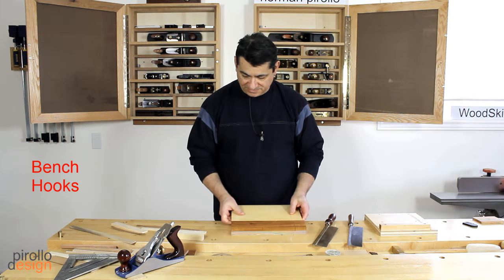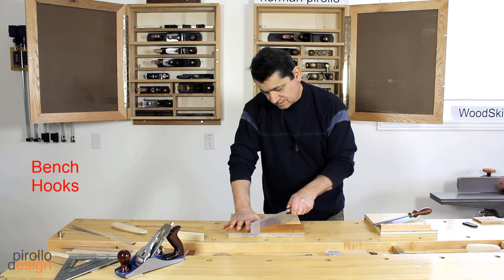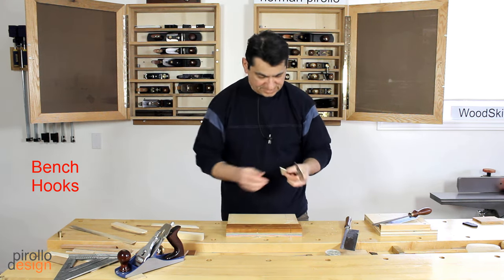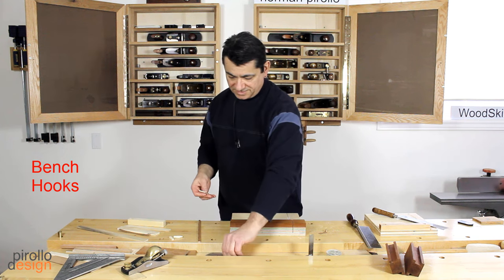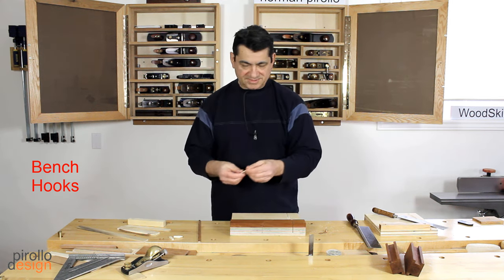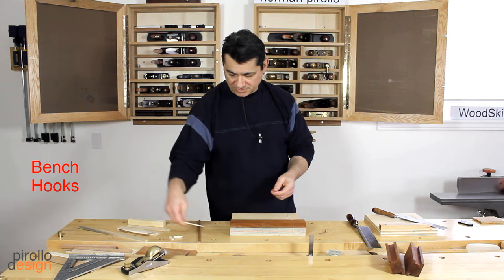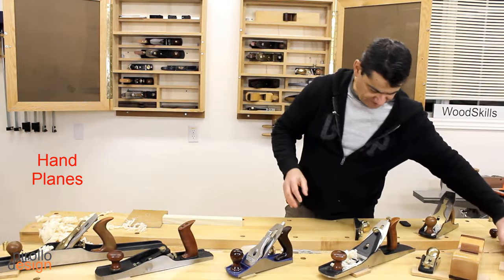For example, if I'm cutting smaller pieces like this at 45 degrees — dead on a 45 — this other component is also 45 degrees and they're fairly well trimmed. You'll never get an accurate cut like this on a table saw or bandsaw, because of the large kerf and the rough surface it leaves. So I highly recommend you build your own bench hooks — make a couple.